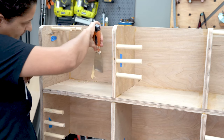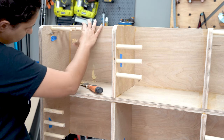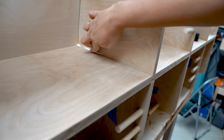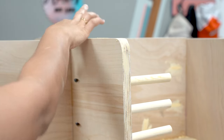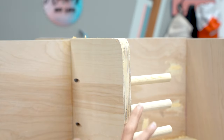I am going to be painting this bookshelf, so I went ahead and filled in all the visible pocket holes, caulked all the seams, and also filled in any voids on the edges of the plywood. If you want to know more about how to get the perfect finish on painted plywood, be sure to check out an article I have on my website, and I will link to that in the description below.